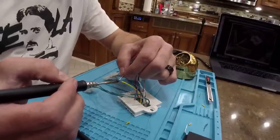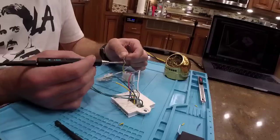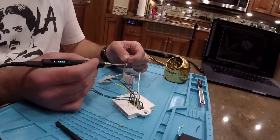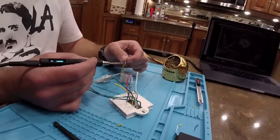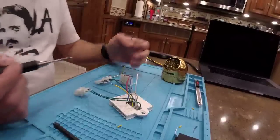That's so true. The problem with that is that if you pre-tin the wires, most of these wires will be too thick to go into the terminal, which is why I didn't do that. And the push connectors for the Honeywell. Correct, for the Honeywell. Now, I am pre-tinning these because I'm getting ready to solder them together to the wires